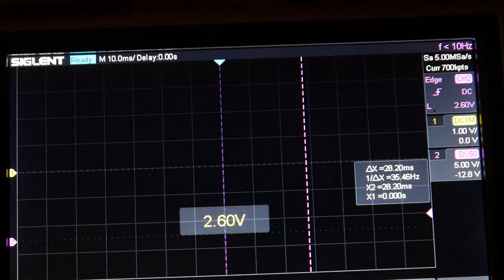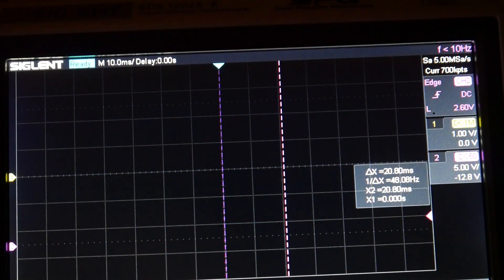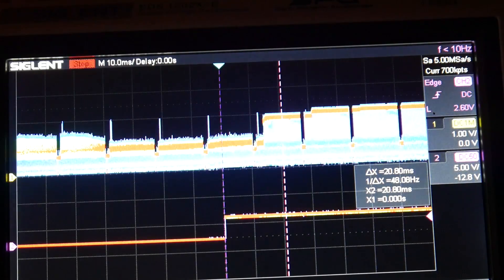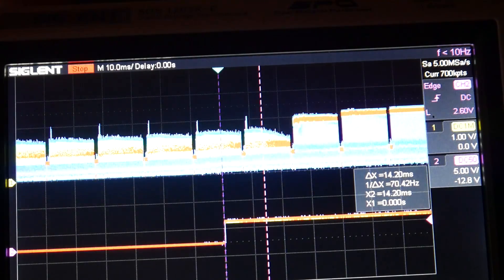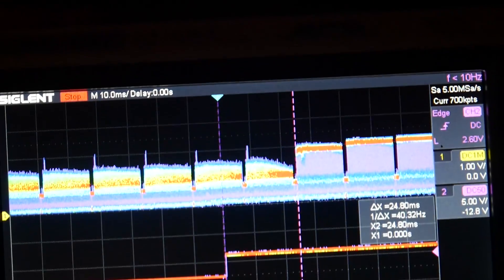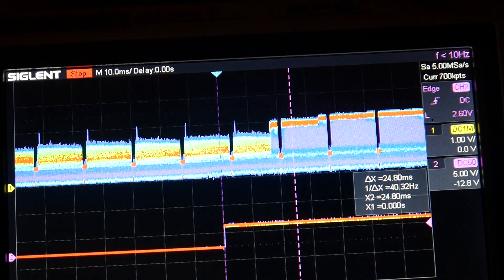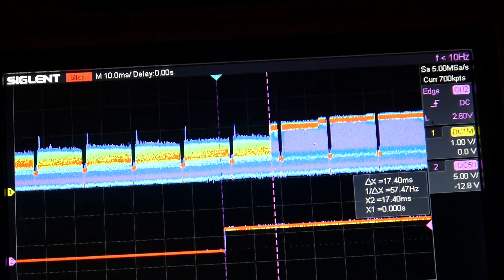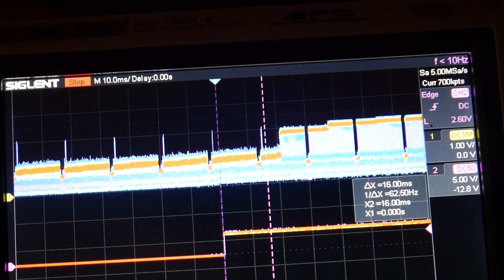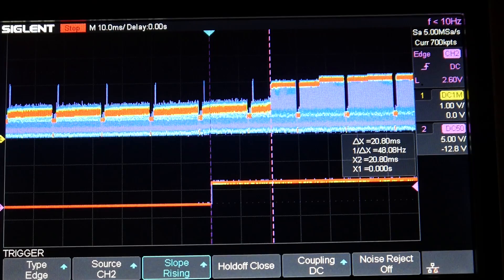Switching to the LED actually turning on. Taking our first sample: 20.8 milliseconds — still good. This one's even better: 14.2 milliseconds. I actually got one test where I got 9 milliseconds but haven't gotten it again, so it's capable of very low latency. It also has occasional hiccup moments above 25 milliseconds but never really breaks the 31 or 35 millisecond threshold. 17.4 milliseconds here. And 16 milliseconds — so the board heating up isn't really affecting latency as I thought it might. 20.8 milliseconds overall — doing really good.